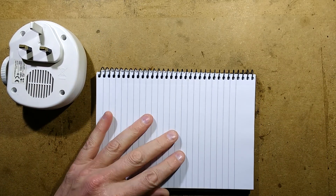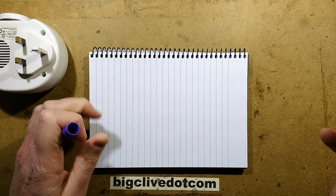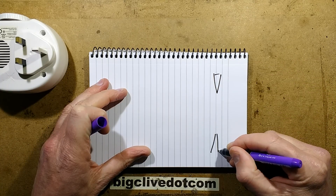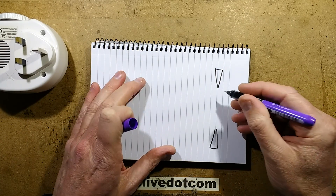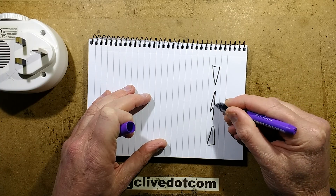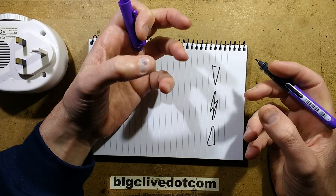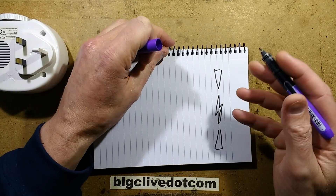Let's bring in the notepad. This is the principle: if you get a couple of electrodes in close vicinity of each other and put a high voltage AC across them, current will flow, but it will usually be in the form of quite a vivid spark jumping straight across. It would get hot, it would burn, it would be really inefficient. These electrodes would get very hot — it would kind of work, but it wouldn't actually get much exposure to the air, which is kind of important.